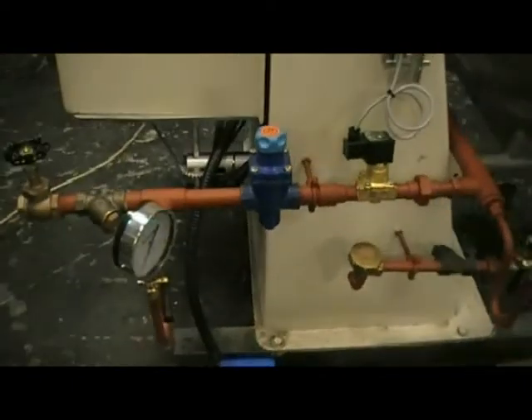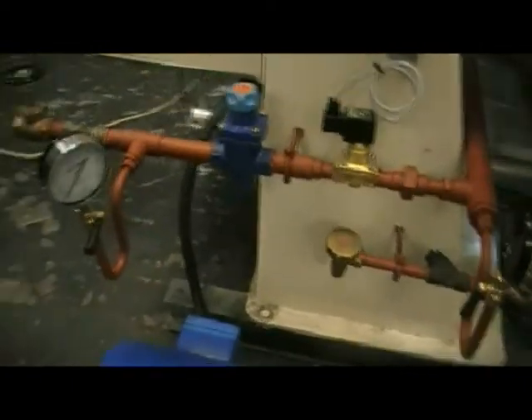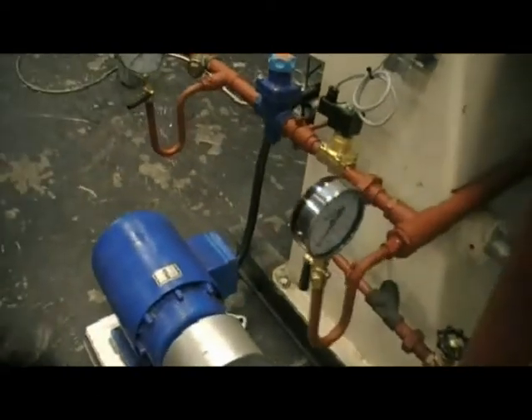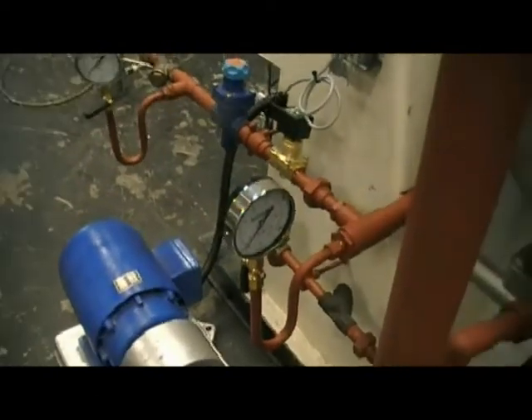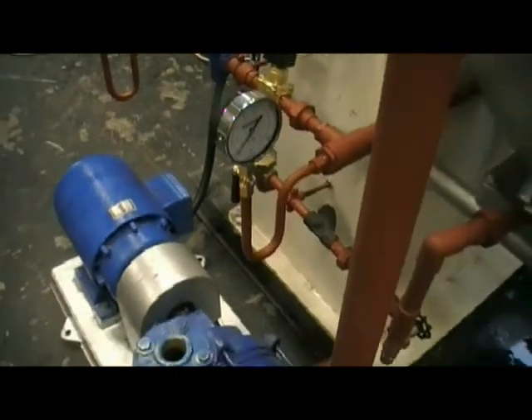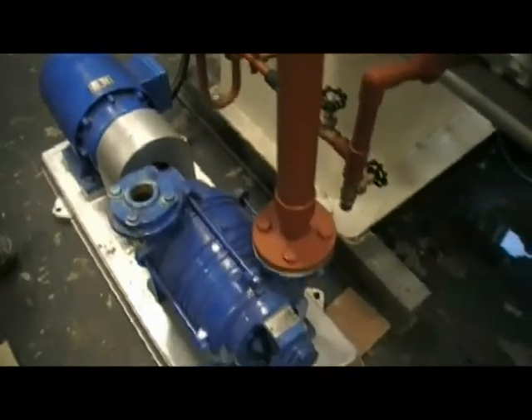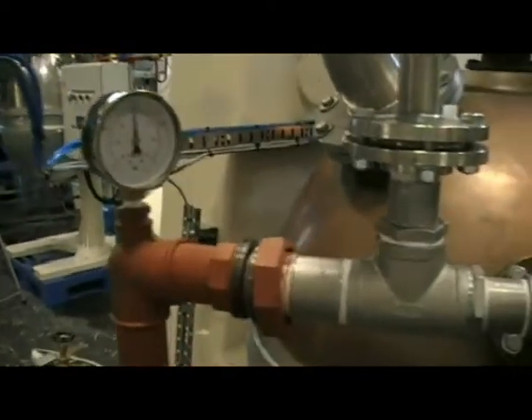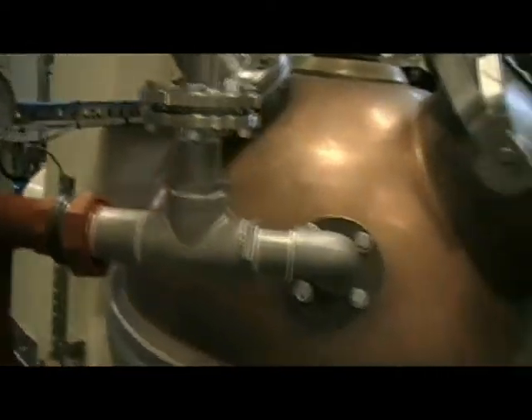The machine is also to your specification electrically, so 400 volts three phase is required to the control panel. All the other devices — contactors — are 230 volts. And the valve control solenoids are all 24 volts as fired by the PLC.